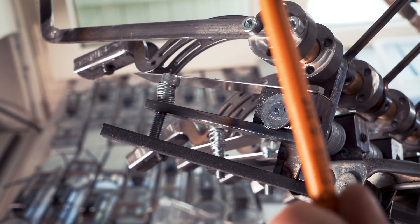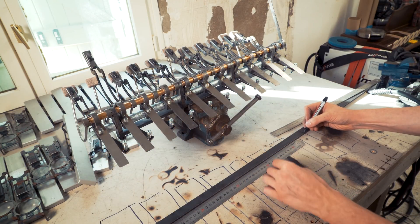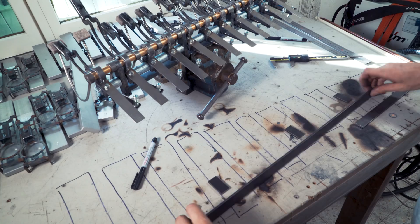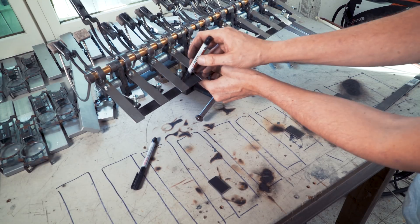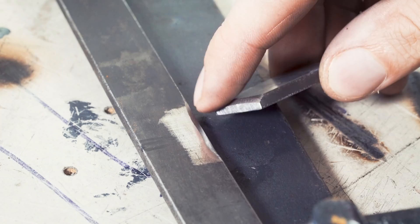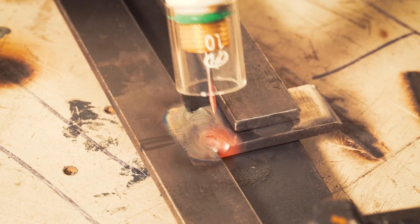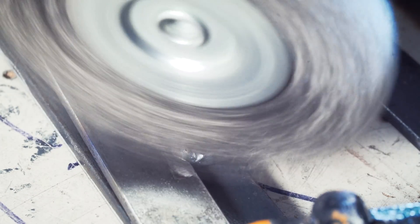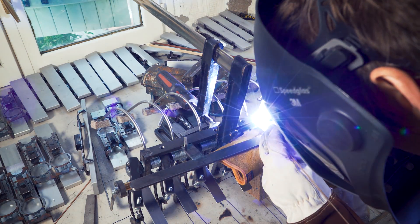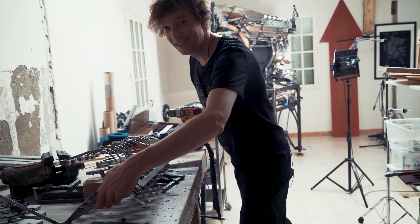Now I have to make the serious version of this stop plate. I learned that you can grind a 45-degree angle in the joint and then the filler rod has somewhere to go. The height adjustment is ready, and we can put the assembly back onto the machine and see if this works.